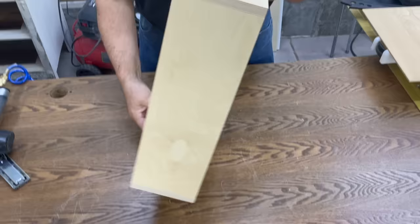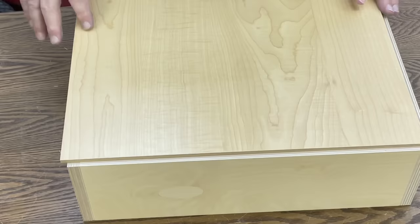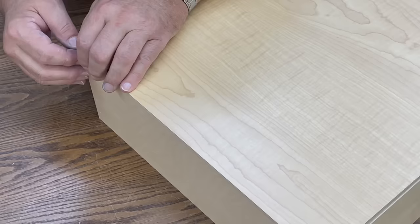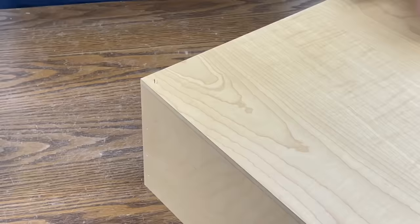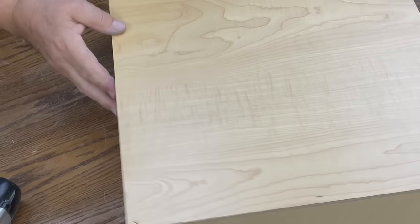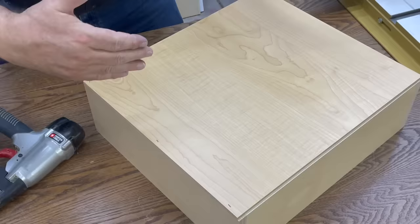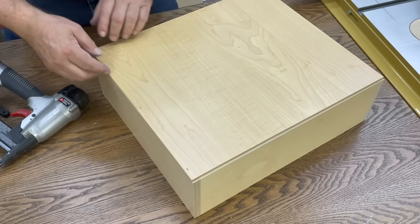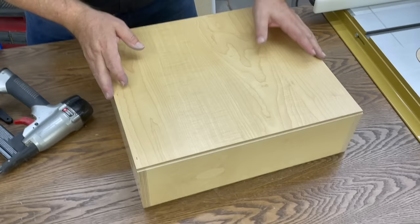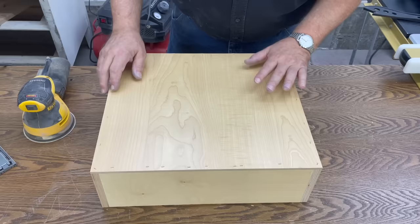Here's our basic box nailed together — sides, front, and back. The bottoms on this are just going to be nailed on because we don't have to make room for an undermount guide mechanism. When I cut my bottoms, I cut them just a sixteenth of an inch less than the size of my drawer box, flush the front corner and the side perfectly flush, and use a three-quarter-inch small crown staple. What that does is allow me to square my drawer perfectly, because my bottom is cut perfectly square. Because it's not oversized, my edges are flush and I don't have any overhang. The drawer is done — they turn out perfect.